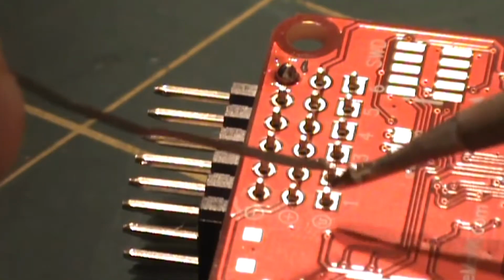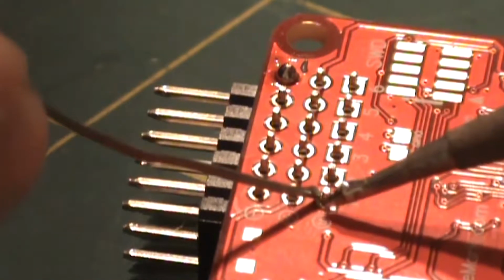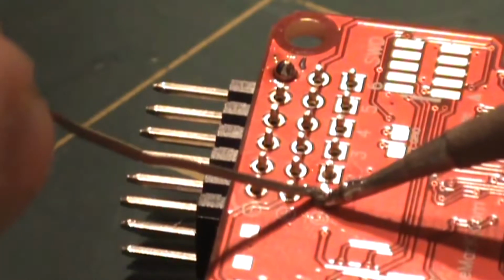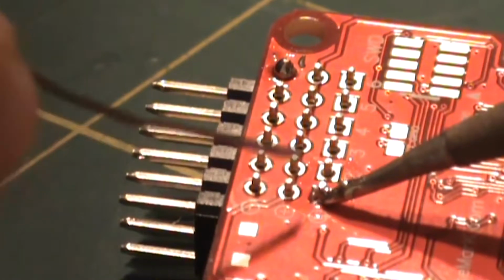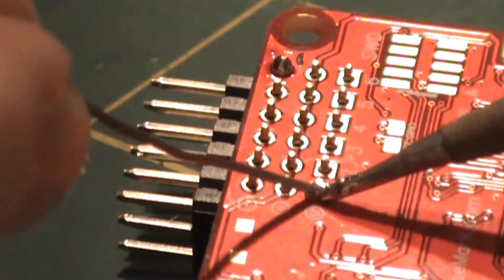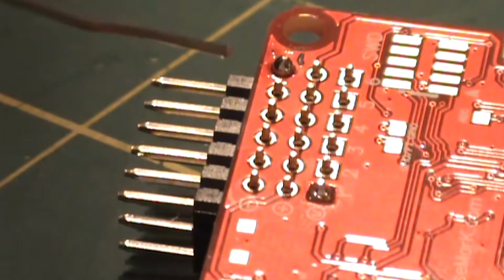If you want, you can go back over this video and watch carefully how the soldering iron is moved in onto the pin, and then the solder is pushed onto the connection and is drawn up by that heat and then quickly taken away, and then the soldering iron tip is taken away quickly before the solder has a chance to set.